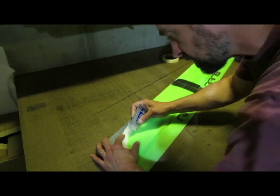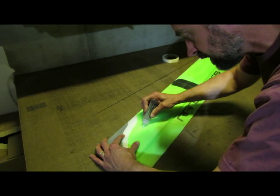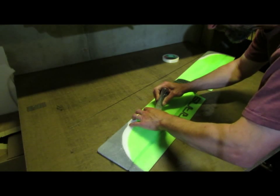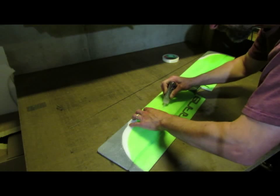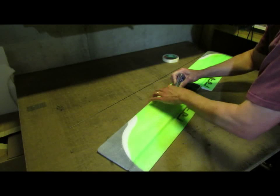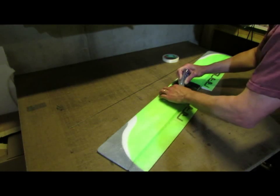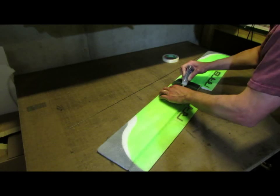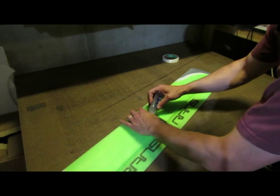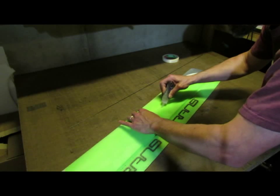And then just put just enough glue down in there, and if I push the tip into the slot, that really gets the glue into the foam down in that slot. And when that slot comes back together out in here, there's just a small, maybe a 32nd of an inch bead of glue that's getting squished back up out of the foam. Just a small amount. Most of it's down in the foam there.